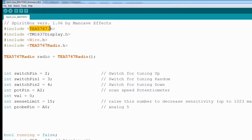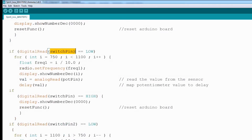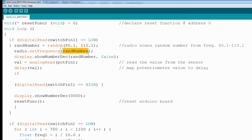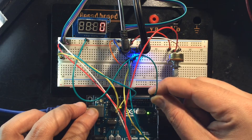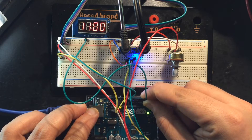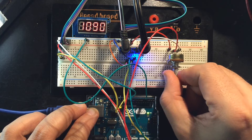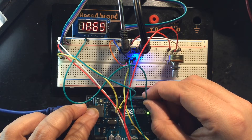Here is my free code for you. We first initialize all our components, then define our inputs for the three switches and the speed potentiometer. This defines the scan direction. For switch pin — this is forward. And for switch pin 2 — this is backwards. Switch pin 1 is where we connect our random switch, so the Arduino board will generate random numbers between 75 and 1100. On the display you see the three modes: forward, random, and reverse. Our potentiometer is working smoothly for increasing or decreasing the scan speeds.